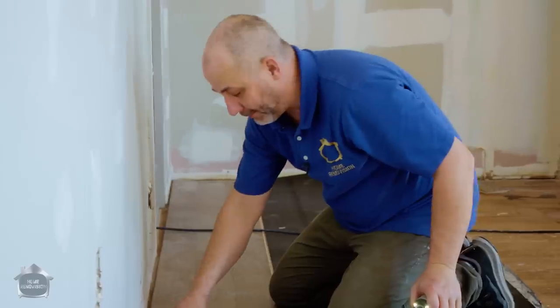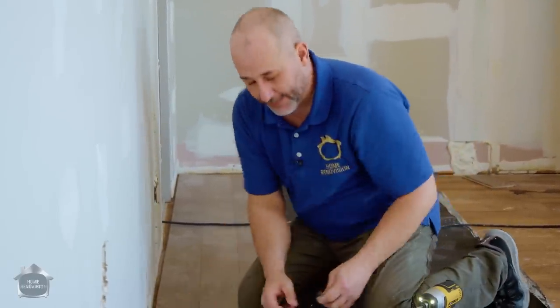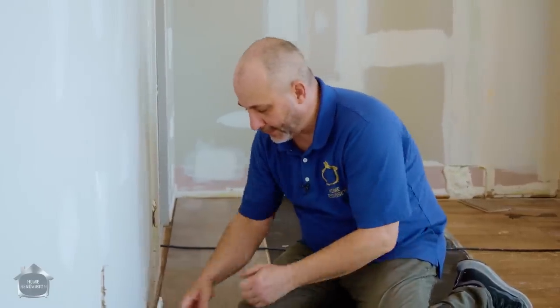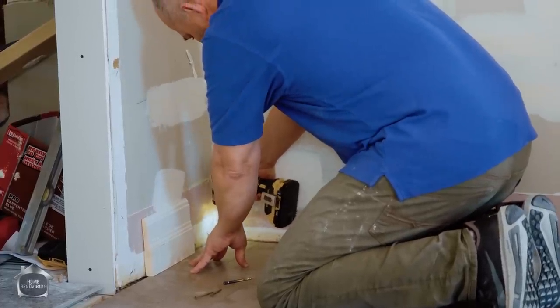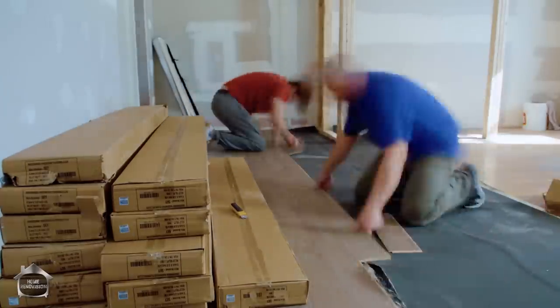When you're all done, come back and remove the screws before you put your baseboards on — they'll be sitting a little proud of the surface. The reason I do this: if you're working around a door frame or closet and your floor has shifted or twisted, you'll get to the other end and have a gap. With screws holding it tight, you're good to go, and at the very end you pull them out and add your baseboard.